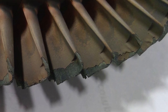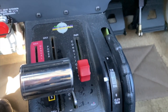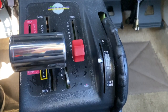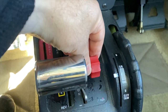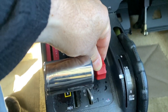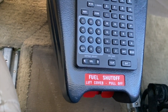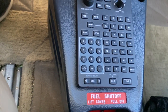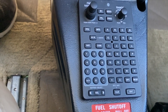Let me also mention the ways at hand for stopping the engine. When stopping the engine, the power control lever should be at idle. To stop the engine, pull the condition lever all the way back — that should do it. But if it doesn't, we also have a fuel shutoff valve: lift the cover, pull off, and that will shut off the fuel. If the engine has to be shut down quickly, fuel first — get the fuel off.